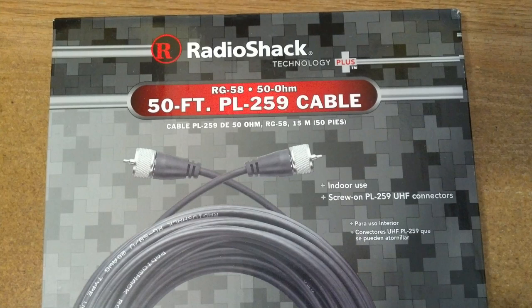Good afternoon everybody, this is North Carolina Prepper. I got a bunch of goodies from Radio Shack when they closed, and I needed to make a 1-to-1 RF choke balun to prevent the RF signal from heating up the coax instead of transmitting. Without the balun, when I key up on my packet radio I tend to lock up my touchpad on my laptop.